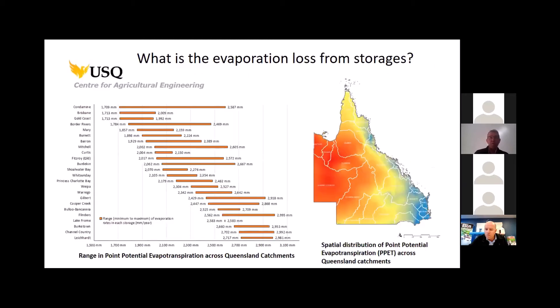How much are the evaporation losses? This map shows how evaporation changes from fairly low at the coast — about 1,700 millimetres — increasing as you go inland up to about 3,000 millimetres, and also increasing as you go north, driven by temperature, cloud cover, and wind. For catchments like the Gold Coast, anything between 1,700 and almost two metres. Up to the Sunshine Coast and Mary River catchment, from 1,800 to just over 2,000 millimetres. So two metres of water lost off the top of your dam is a significant amount to worry about.